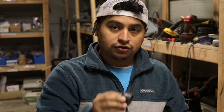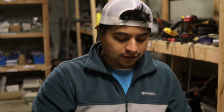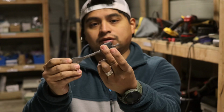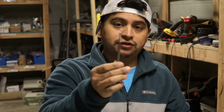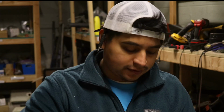If you have maybe a bigger hole that you need to make, you could also use a little doorknob hole making kit. So they usually come with a bit sticking out, not like this, but a straight bit that'll start your hole, and then that'll cut the hole out. So we also used one of those. We had a bigger valve on one. So make sure you have this before you start, because you're going to need it to cut out your holes for your shower knobs.